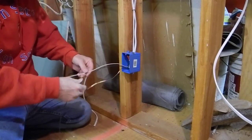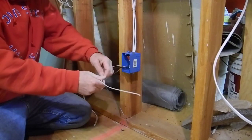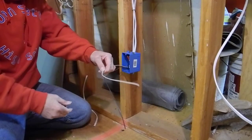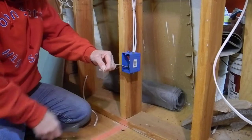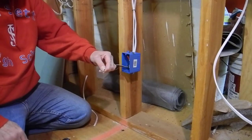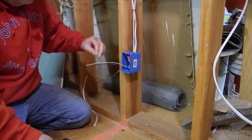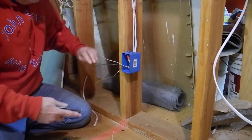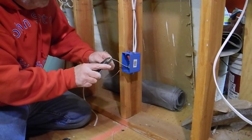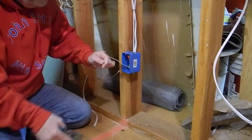So while you do that one last — we're going to cut these all the same length. What we want is to be able to fit it in there; you don't want it too long, but you don't want it short either. So we'll just cut all that off. You can see out of all that there's a little bit of waste, but these are almost long enough to use as a pigtail on another circuit. Strip that, strip that.